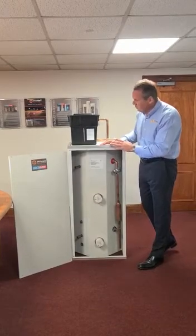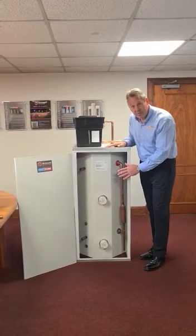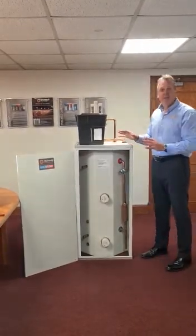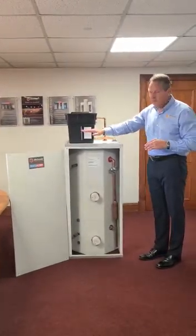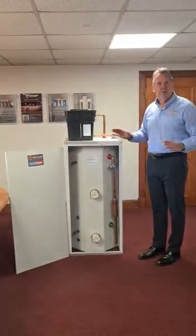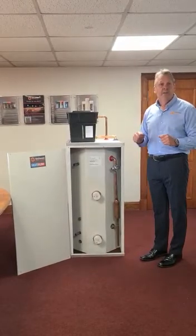There are no maintenance requirements. You'll also notice there's no pump, no plate heat exchanger, and no PCB, so it's nice, easy, and straightforward with no added expense. No annual maintenance with thermal stores — it's worthwhile sometimes just checking the water level. The front cover comes on and goes over the front, covering up all the electrics and mixing valve, so householders can get easy access.